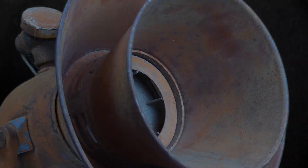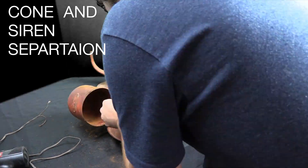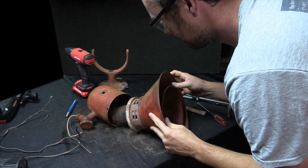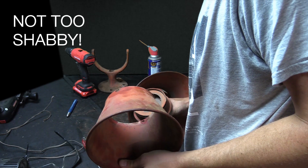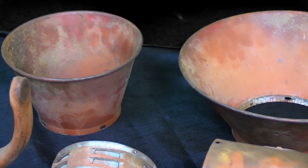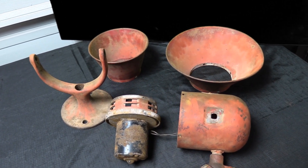We got the siren apart and now we have a better idea of the condition of the internal components. The siren itself has a significant amount of rust and corrosion and some oxidation on the aluminum housing. The main housing has a good amount of rust on the inside and we had to dump a pool of rust chips out in order to clean it all out. The bell housing and the base are in pretty decent shape — there's only a minor amount of surface rust and surface corrosion, but the paint did a pretty good job of protecting it from the elements. So we're really gonna get the laser fired up and see what it can do on this old World War Two air raid siren.